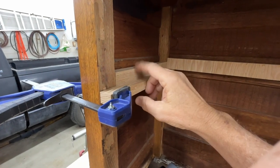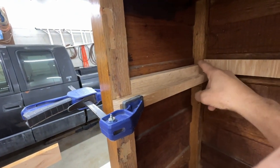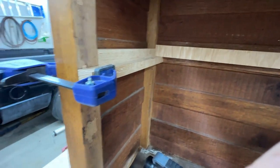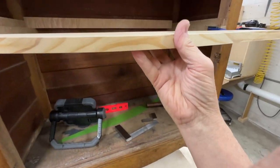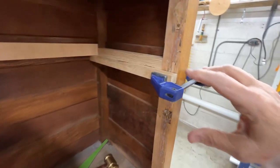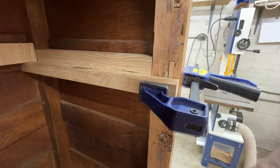What I've got is the L shapes. I know it was somewhere in there, but anyway, I got them cut for the space in right here. This is a gauge set to hold it back where it should be. Once I mount them back there, this will go away. This right here is my template, because I want to use this to work that other one. But anyway, this will have the real one, but have the mortise. So I am putting here the tenon. I'll probably cut this back about halfway and then make a tenon right here to receive the mortise there.